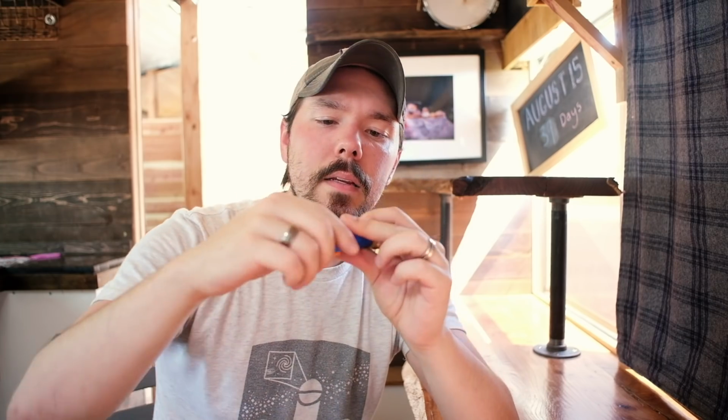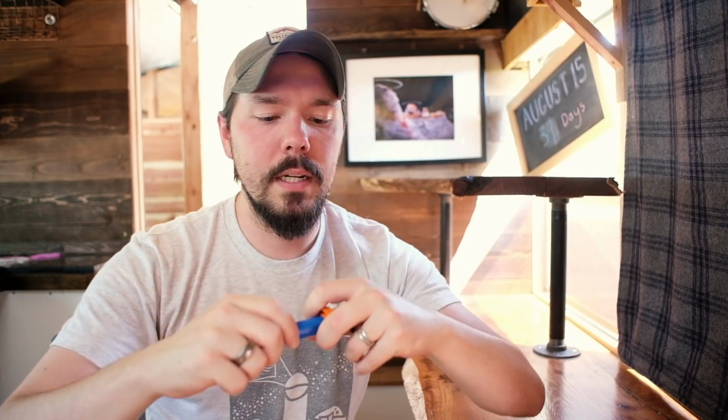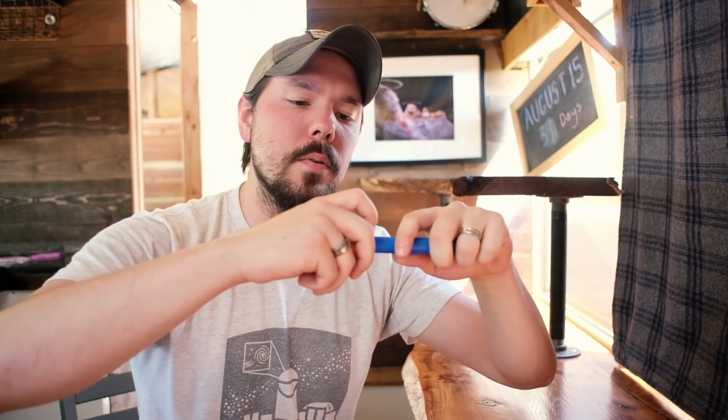So this is the piece that I had to run to Lowe's for. I already lost one, you can see, because it's so small. But basically this is just a disconnect clip. All you do is put this clip onto the PEX like so, and then push it against this plastic collar around the fitting. Push against it, pull the tubing away. Too short. There we go. It helps if it's not at an angle, if it's pulling out perfectly. But then, yeah, you just pull it out, and then you can start over again. You could use both this tubing and the connector again.